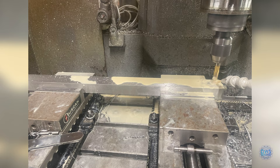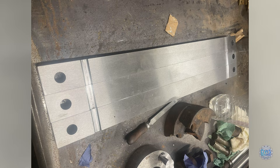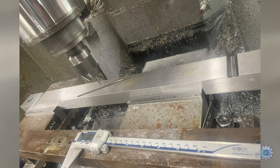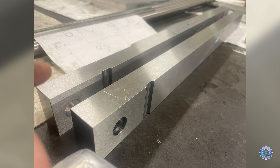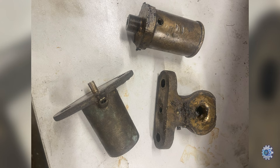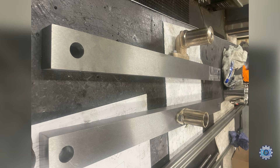So these are the slide bars being machined up — using some ground stock gauge plate for this. It's quite a bit of work involved in making these, putting all the oilways in. They come out quite nice, and of course you haven't got to grind them because they're already ground stock and they're hardened. These are just the oilers that go on the slide bars — did a bit of abrasive blasting and polished them up. They look quite nice.